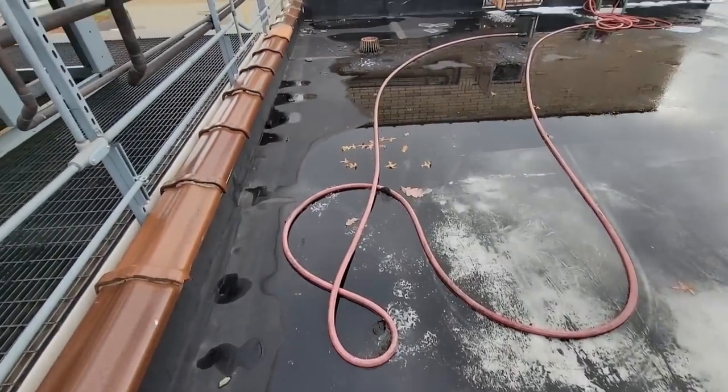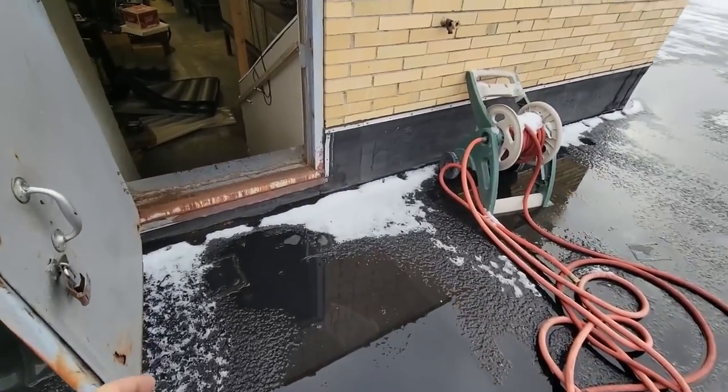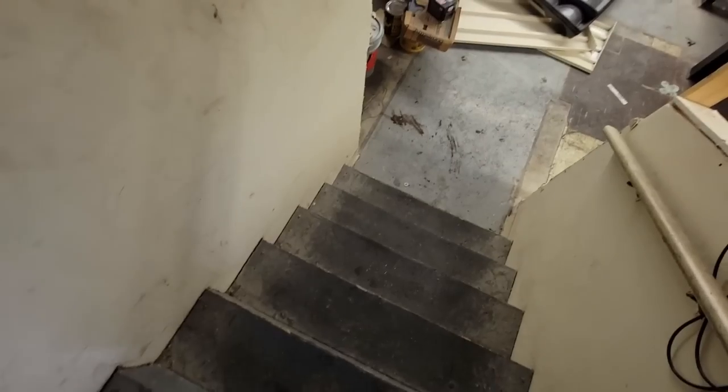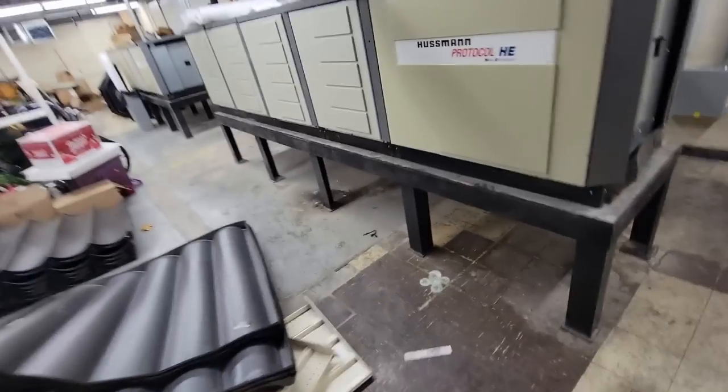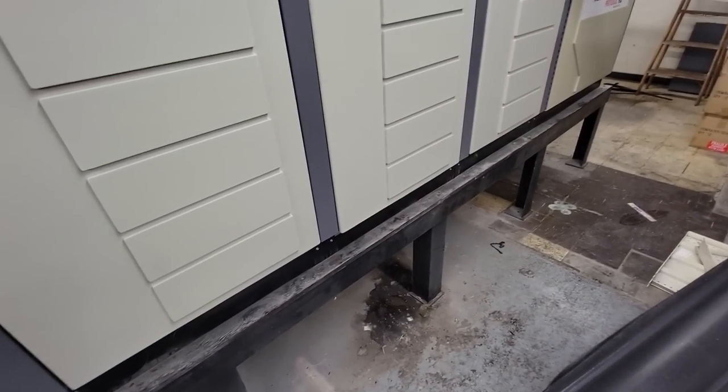Last time I had a leak here, it was catastrophic and the whole store went down. It was because it blew a hole out of the side of the compressor. A high voltage line ended up shorting to a refrigerant line in one of these compressor sections, which vibrate like crazy. So let's go ahead and yank some of these out.